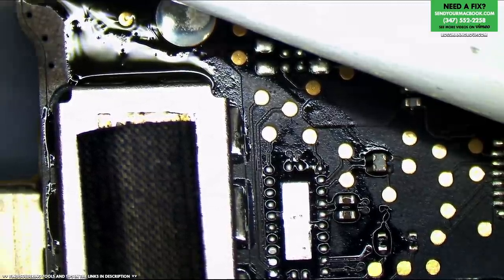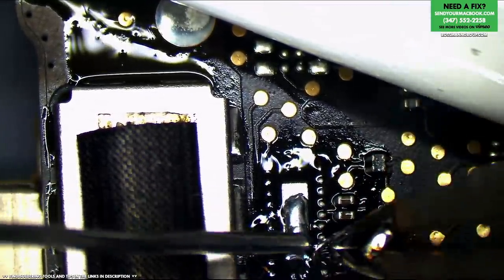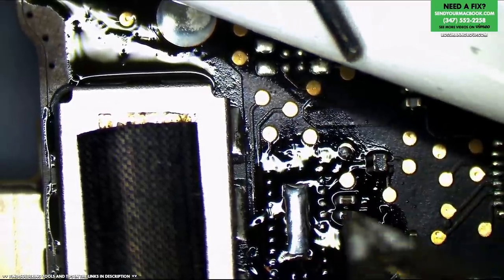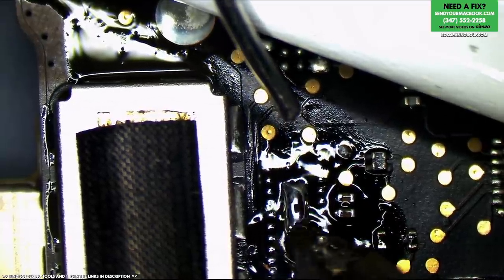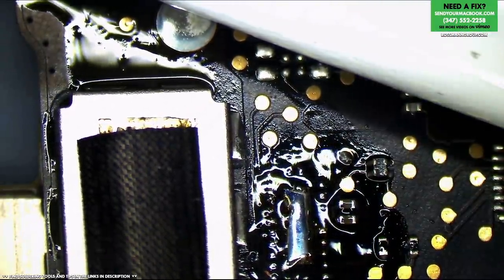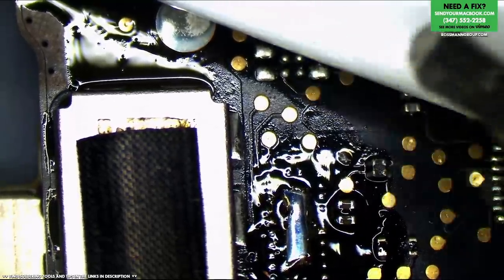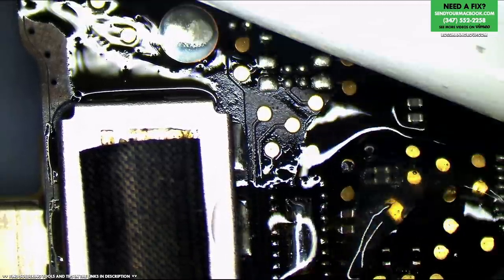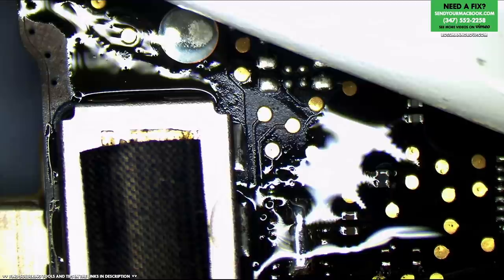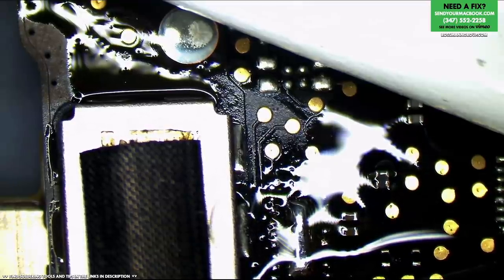Paul Daniels is back — everybody give a nice round of applause to Paul Daniels for producing this amazing software, and to Pierinov as well who assists Paul Daniels. Both are talented board repair people and programmers who deserve more credit and money than they get. Paul mentions the same issue with the 00138 — try troubleshooting the MEMVTT enabled circuit using any of the other available schematics and it'll drive you nuts because the transistors are all opposite. You have to trace back from the resistors and use the dots on the transistors to figure out which way they're oriented.